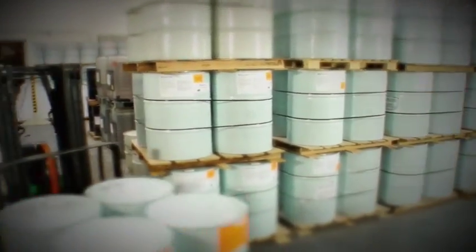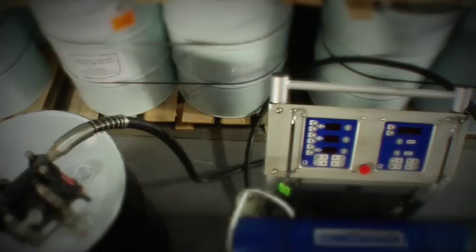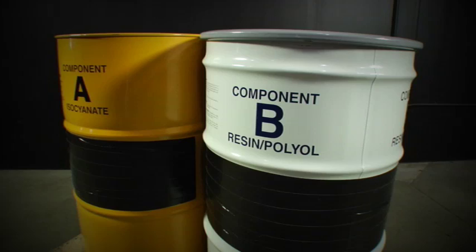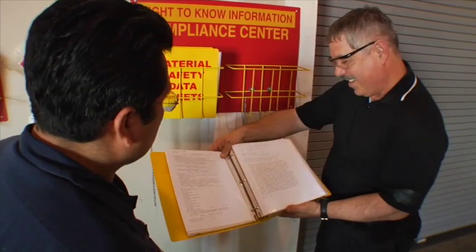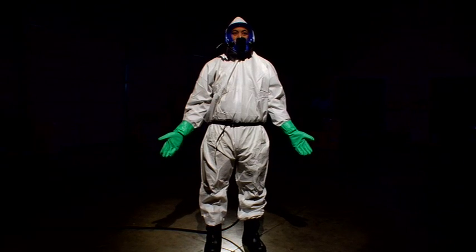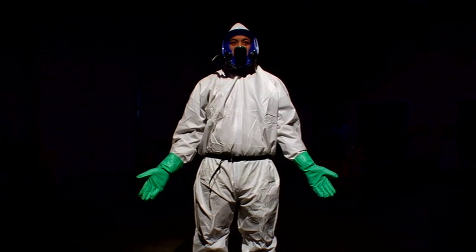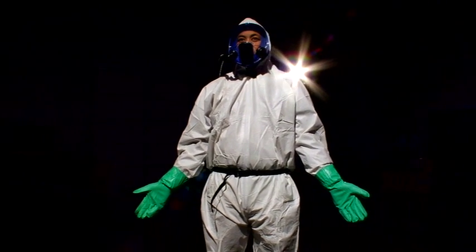But more important is your personal safety on the job. Polyurethane and polyurea protective liner systems are made by combining an isocyanate such as MDI with a polyol resin blend that may contain a mixture of several chemical ingredients. These materials require you to follow defined precautions and procedures and to use specialized personal protective equipment, or PPE, to protect yourself and your co-workers from becoming overexposed to these components.